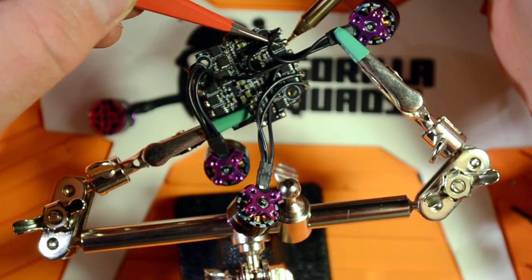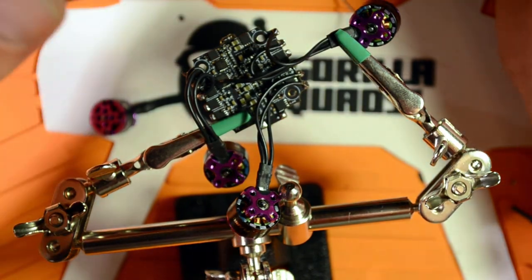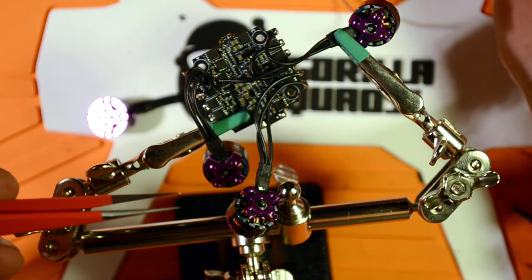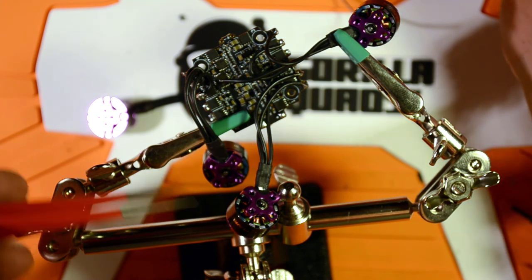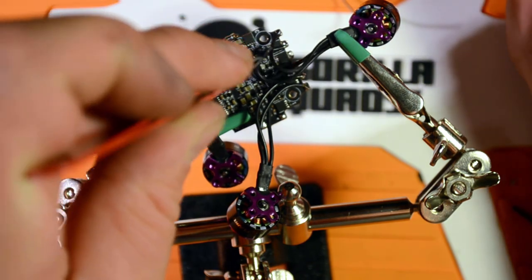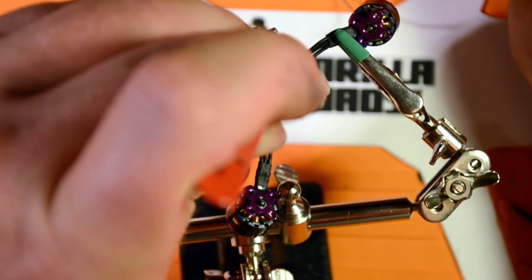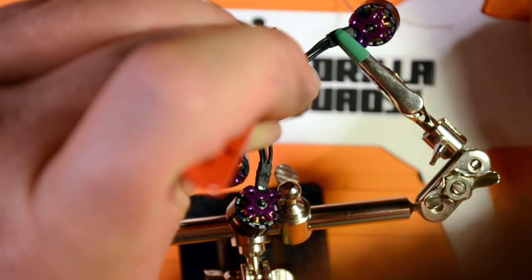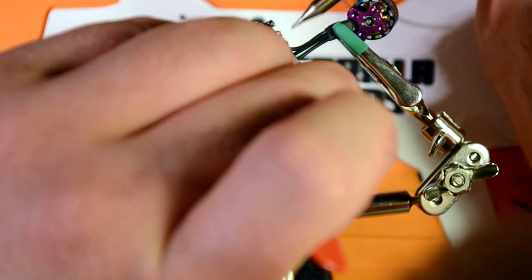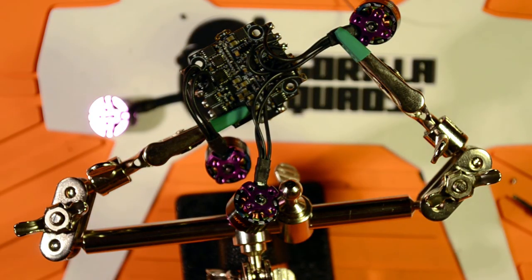Just about any soldering iron can get up to super high temperatures, but as soon as you touch it, the work is pulling heat out of the soldering iron. So if your solder iron is a low wattage, you can get to 600 degrees pretty quick, you can stay there, but as soon as you touch it, the work pulls heat out of the tip, and your iron cools off. And if it doesn't have a big enough element, or if whatever controls the element isn't sensitive enough, your temperature will drop. And then you end up with cold joints, poor joints, and just general crap solder joints in the end. And that's when things start breaking and people get frustrated.